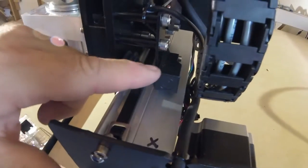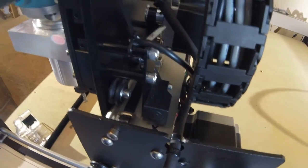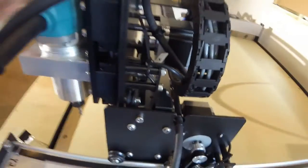Right there is your proximity switch. That switch has to sense this piece of metal. If it doesn't sense that piece of metal, it will sit there and grind and make all kinds of crazy noises like you heard. It's your first troubleshooting tip.